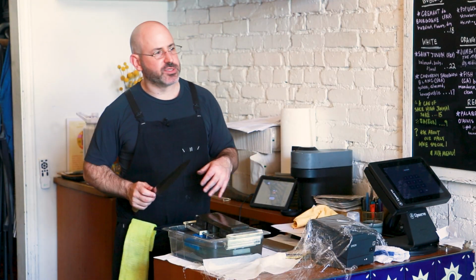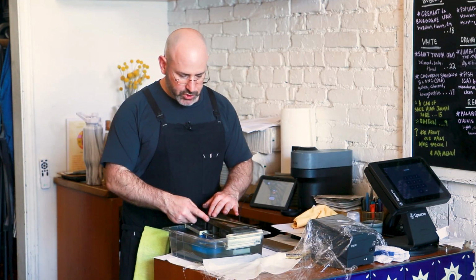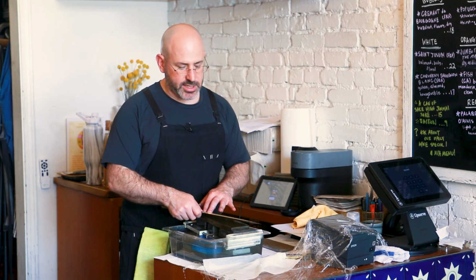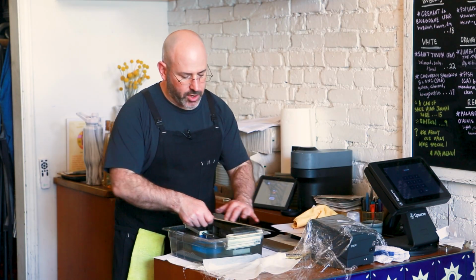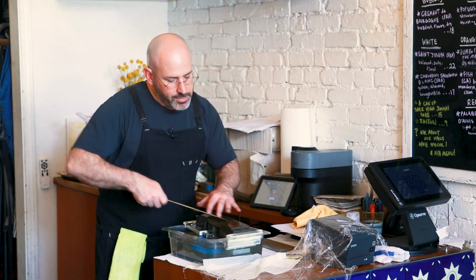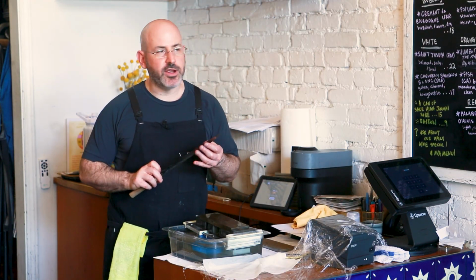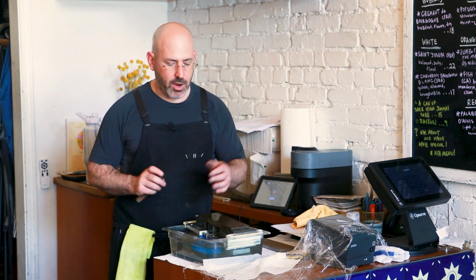Now I want to apply this micro bevel. I'm just doing that on my very finest stone. So here, where I was sharpening like this before, now I'm going to lift up for a much, much higher angle. Like I said, somewhere in the 45-ish degree range. And I'm going to apply light pressure on my edge trailing stroke, making my tip adjustment. And this is going to form a very, very easy to feel burr, right? Now I want to get rid of that.